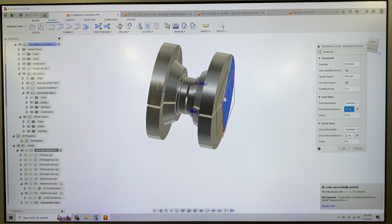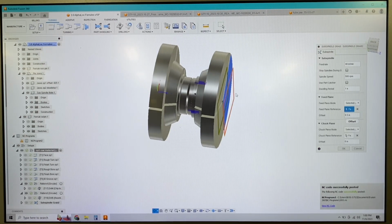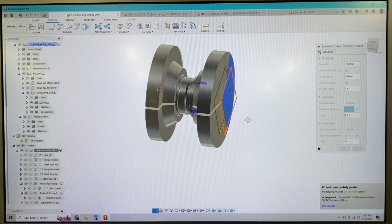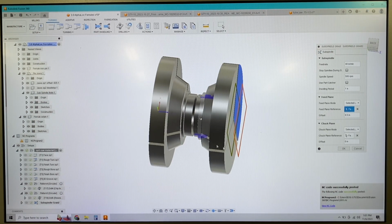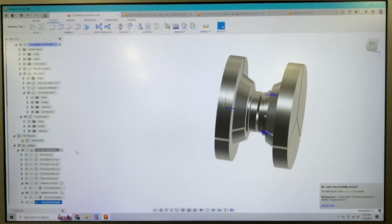as its positioning geometry. So we have our feed plane, which is 1/2 inch out from this face. It's got an offset of 1/2 inch, and then it'll feed into basically its 0, which is the face of that chuck, modeled accurately in this entire assembly. So hopefully that kind of makes sense to you guys. These parts aren't super complex, but this handoff strategy is pretty cool.